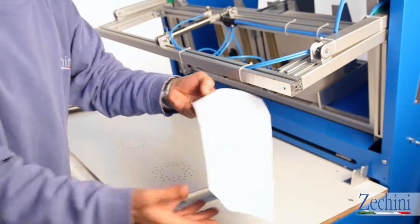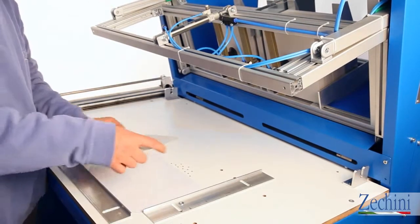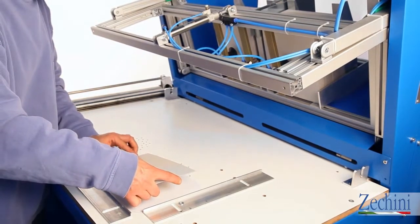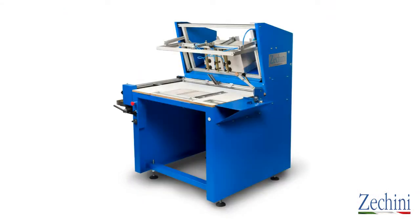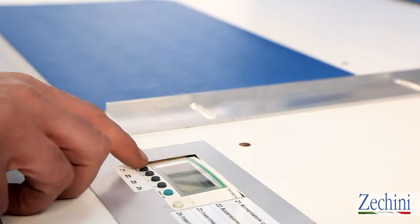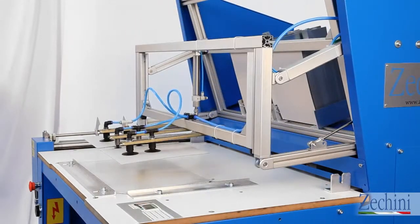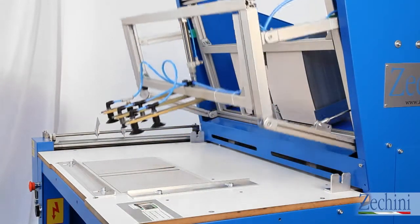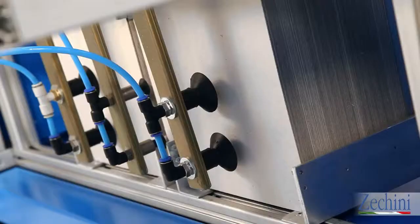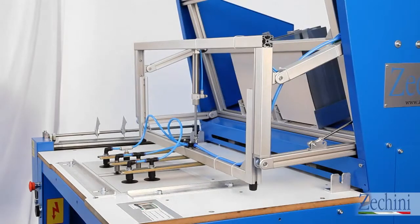A series of fans inside the mounting table helps keep sheets still. Another development is the automatic board feeder. By pressing a button, the new Robbie Jr. II automatically positions and presses the cardboard onto the paper without any effort on the part of the worker. Suction cups are provided to extract the cardboard from the feeder and align it perfectly onto the glued material.